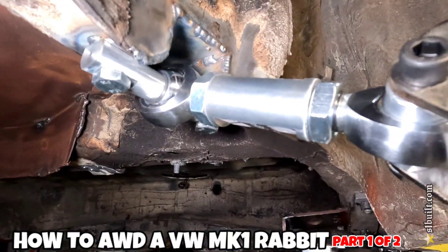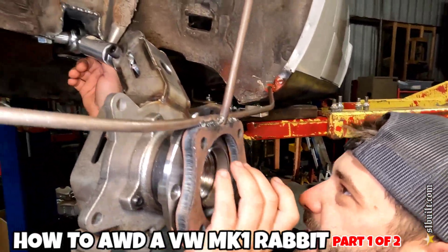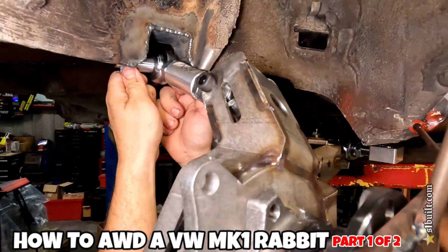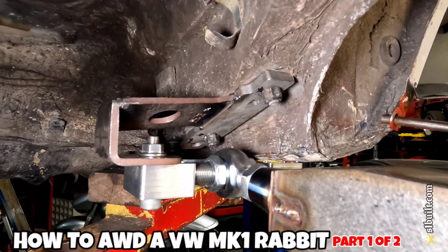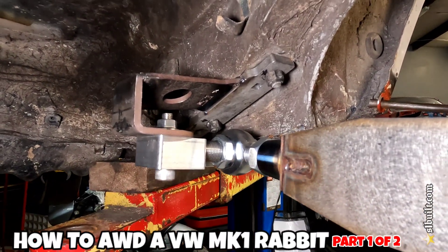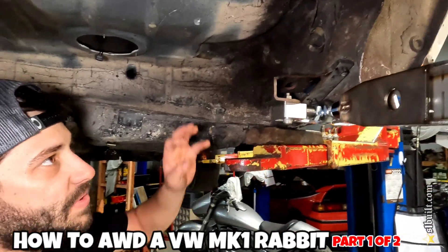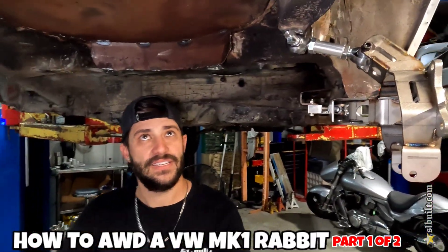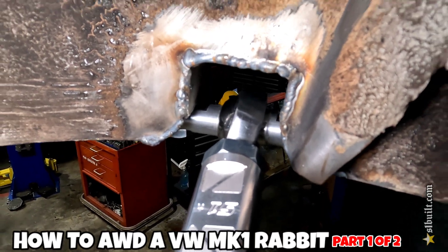After our mock-up with the hubs we got our arms pushed up today and some things are getting started. As you can see, the camber kit up here is boxed out and bolted in almost like a factory bolt-in camber kit. We have a mock-up — not a finished product — of what we wanted to figure out in this area. We're going to build something that's all one piece with bracing from this arm up to that arm so there's no movement. Once we finalize this section we'll start the other side tomorrow, then move on to the diff mount.